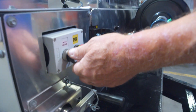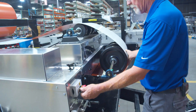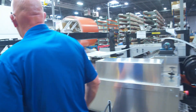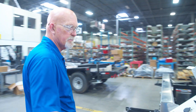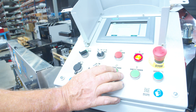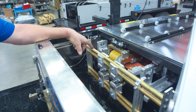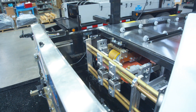We have the control switch here with forward and reverse. We're going to get the coil loaded up. We've taken the cover off and we're in maintenance mode, as you can see, and we're running it from here. We'll bring the material up just past the last roller, and then we can go ahead and set our guide.